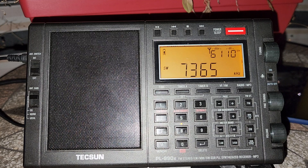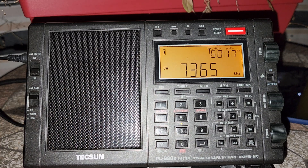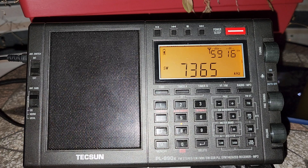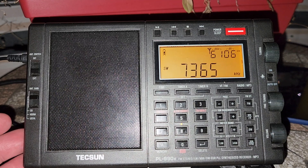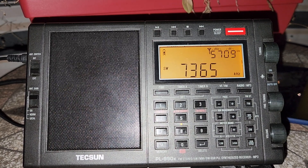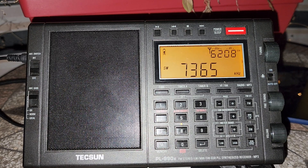RF gain is more about playing with the radio's internal gain or sensitivity. Driving the RF gain up and down actually changes the sensitivity. So the attenuator adds a circuit to remove some of the signal, while RF gain plays with the radio's natural sensitivity itself — tweaking the RF amplifier that amplifies the signal to make it more or less sensitive as you want. The purpose is the same: RF gain is mostly to reduce the possibility of overloading the radio with very strong signals.